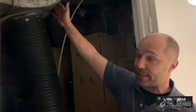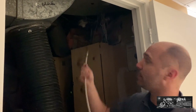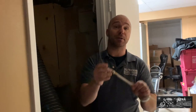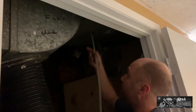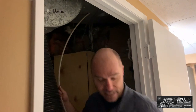Here we have the vacuum — it's now hooked up to the ducting. The air line is connected to what we call a whipper line. This is where the air is directed. In this case, I'm going to be using a scorpion and I'm going to scrub the duct system. I feed this through an air line hole, and now everything that I'm about to loosen is dislodged, and the incredible vacuum pulls it out of the system.